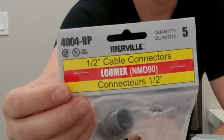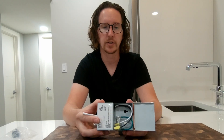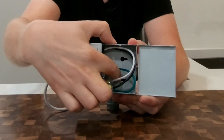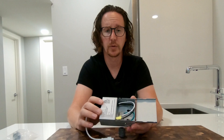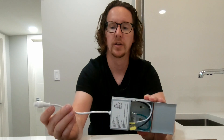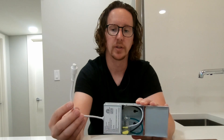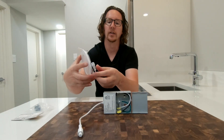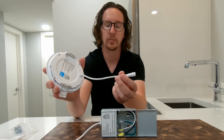This is the item you're looking for. When you get the box it's going to look like this — open it up and you've got access to all your electrical connectors as well as the two screw holes at the back for fixing this box onto a stud in your ceiling. When doing the rough-in you're going to want to mount this electrical box first, making sure it is relatively close to the hole where you're placing your light, because you only have about eight inches of line coming out between this piece and the section on the light.